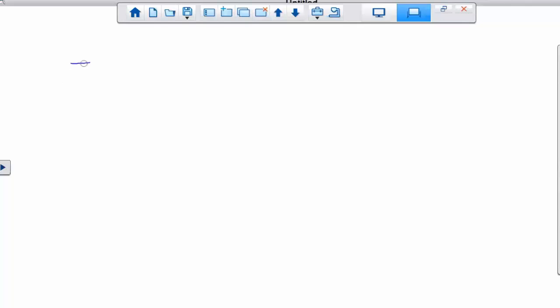And so the first portion of this circuit is pretty much self-explanatory. It's just the transformer which is used to step down the voltage. But this is not a requirement for a bridge. You don't necessarily need to have a transformer. Unlike the previous circuit, remember the center tap is a must. For example, if you don't have 4 diodes and you have only 2 diodes, then you have to go with a center tapped transformer. But if you have 4 diodes, then a transformer is not a requirement in order to build a full wave rectifier. You can do it without the transformer as well, but in a lot of applications, a transformer is required to step down the voltage.